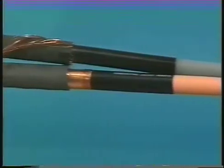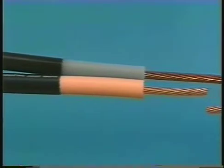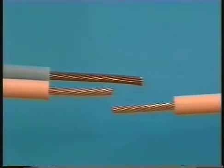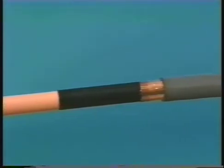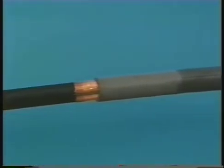In this program, we'll be splicing a 15 kV single conductor extruded dielectric copper tape shielded main cable to a 15 kV single conductor wire shield tap cable using an HVSY 1522S kit.